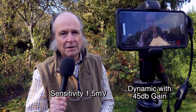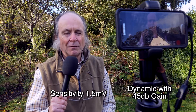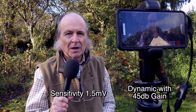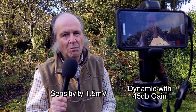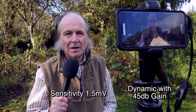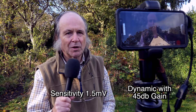That's 45 dB of gain on the dynamic microphone — the volume levels should be much better now. The dynamic microphone only outputs about 1.1 to 1.5 millivolts maximum, so it is quite a low output microphone and requires quite a bit of amplification. It's really only properly usable at this sort of level close to the mouth.